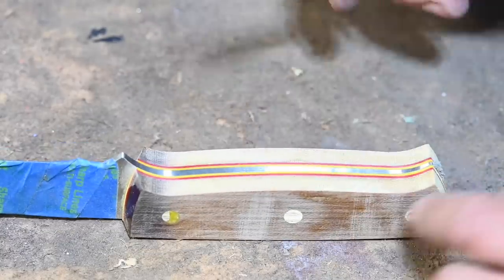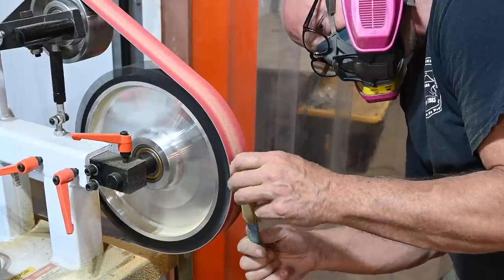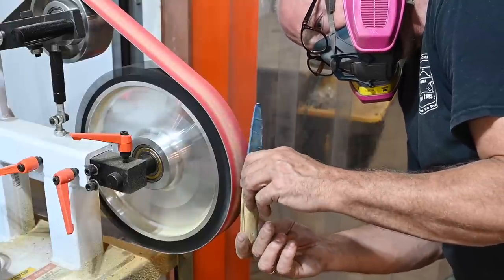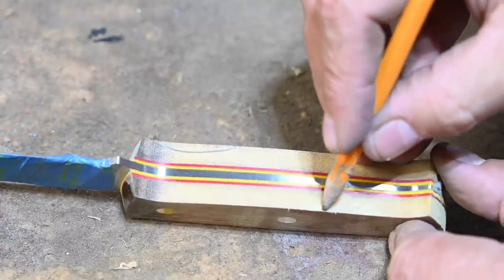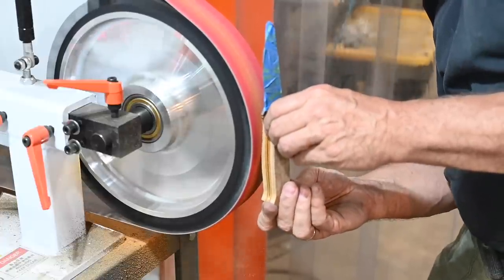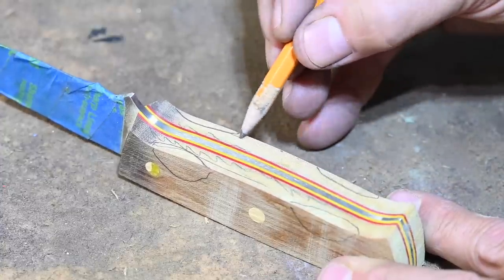Here's the basic idea. First he does the interior or bottom side of the handle, then the top or spine side, and then he sort of bridges his way from side to side, rounding everything off so that it all flows together. He sits in a chair to one side of the grinder so he can look straight into the side and see clearly what's going on. He grinds a sort of facet or divot right here and right here, then moves to the other side of the grinder and grinds here and here — always grinding on the high end of the handle for maximum visibility. Once he's got that foundation for the palm swell in there, he grinds a much smaller facet on the remaining part of that edge, leaving a thin sort of landing strip in the middle, all to prepare for rounding everything off later.